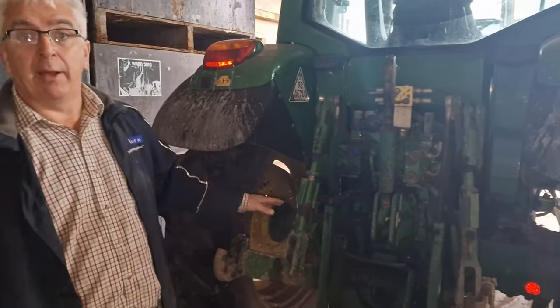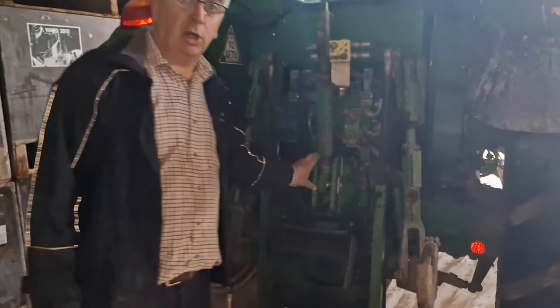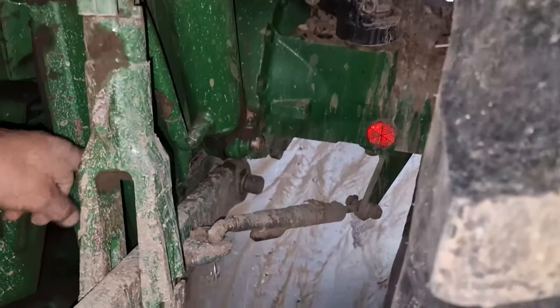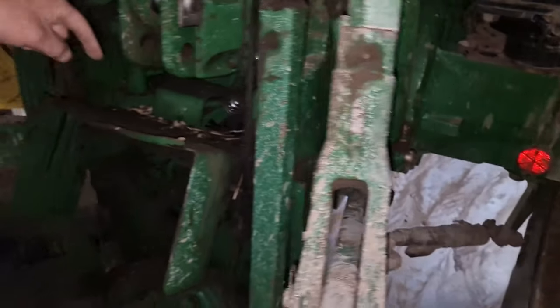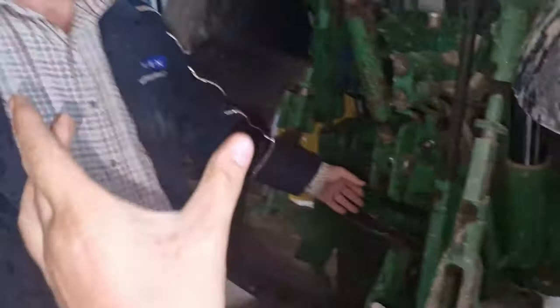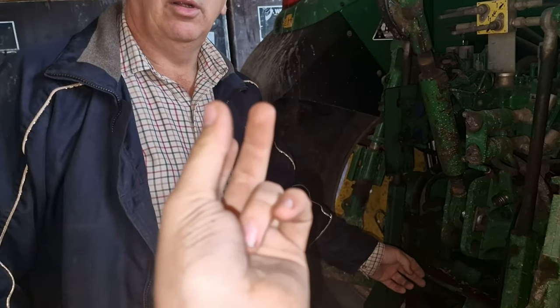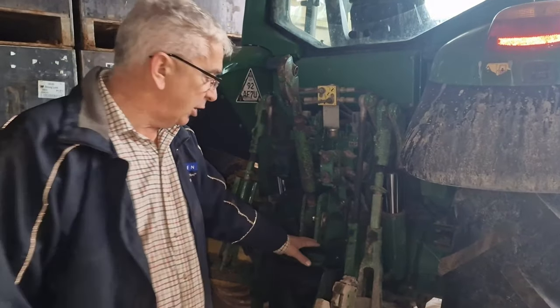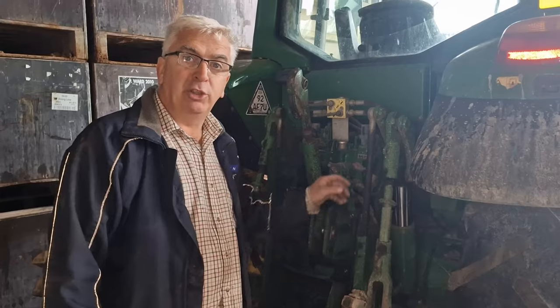Now we're on the 1630 - that's what you were playing with the other day. You can notice we are rigid on the top link here - same again. So that's rigid, it's bolted on there, that's not moving anywhere. Down the bottom, the sensor is actually the pin going across and it's measured inside on these. That bar goes all the way across and there's a spring in the middle, which has a sensor that the spring and bar nip between. So the more the bar bends, the greater the load in effect. That's how this is measuring the amount of draft needed. It's inside and not external, which is good for protection, but a bad point if you ever had to replace one - it's a pig to do.